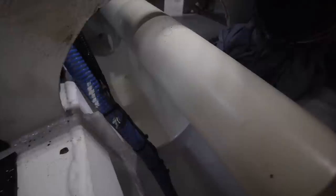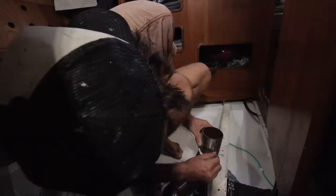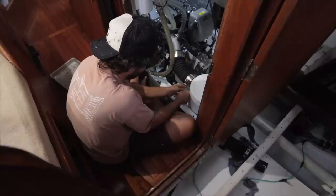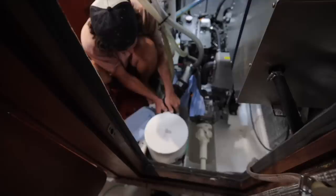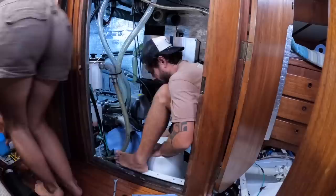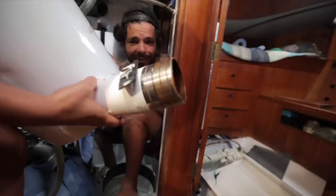When it comes out it's gonna be a lot of water. We officially have a lot of salt water on our build. The problem is this weld right here. We added some epoxy — a cold weld — just to try to solve the problem, but it didn't stop. As you can tell, this epoxy didn't work at all; there is no good bond. Inside is really good, and maybe the water lock there also has a little tiny dot. A lot of water. As you can see we have a dot of rust here — that's probably a weld that failed. That's the proof that two little tiny dots can make a mess.